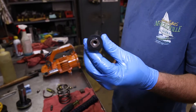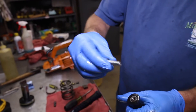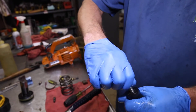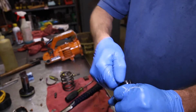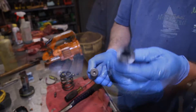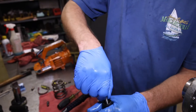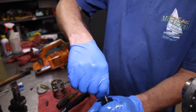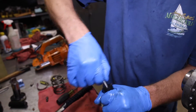Step 10 is installing the new airbag in the front housing. This is the old airbag from which we need to retrieve the fitting — take the bolt, screw it in, and simply pull it free. Now take the new airbag, squeeze and insert, and make sure it is seated properly by pulling up and making sure it's even. Then remove the bolt.